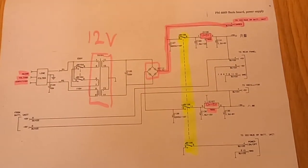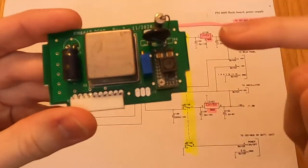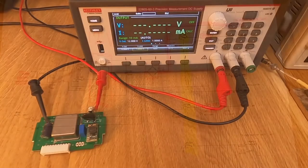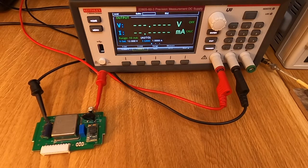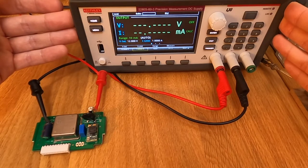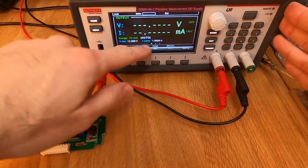That's why on my custom design I have a small switching regulator module that generates 5V for the OCXO. Before going further, I did a quick power supply test using my lab power supply to measure power consumption. The first time you turn on a circuit like this, you want to do it step by step - solder the power supply first without the OCXO, check for short circuits, check output voltage. I've set up the power supply at 12V as this approximates the transformer output for realistic testing.